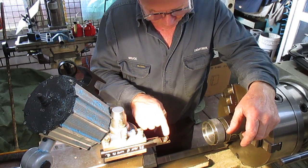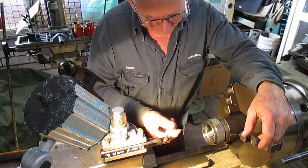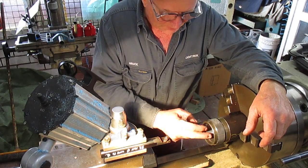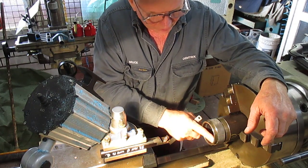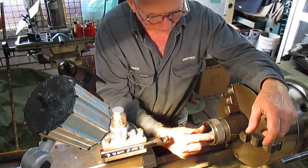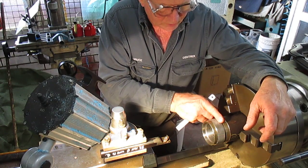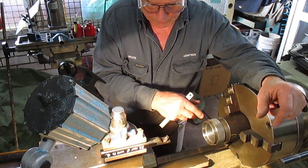I got those this morning to do the job because all my other ones weren't deep enough, big enough to do this thread. And I'll show you how that's done quickly and finish the thread off. Now all that's left — I've done all the facets inside, the 45 degree cut that they wanted — this part to the depth and I'll now trim it and cut it off, trim the end back, make sure that the backside is completed and job done.